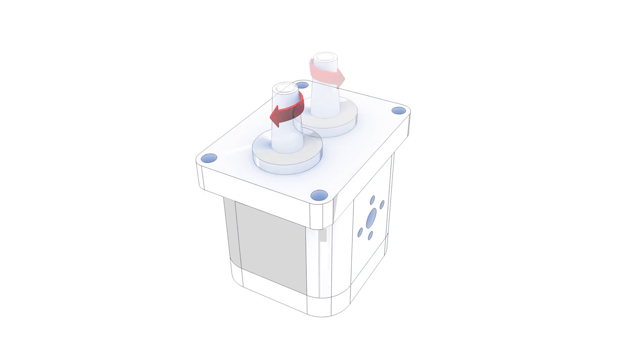Hello, my name is Chris Jacobs, an engineer in Group HES Stores, and I'll lead you through the changing of the direction of a gear pump. The position of the drive and driven gears need to be reversed. The inlet and outlet ports do not change, with the bush block being replaced in the original position.